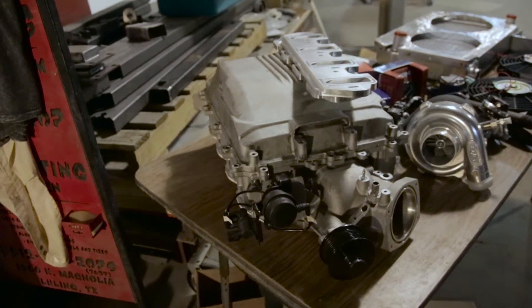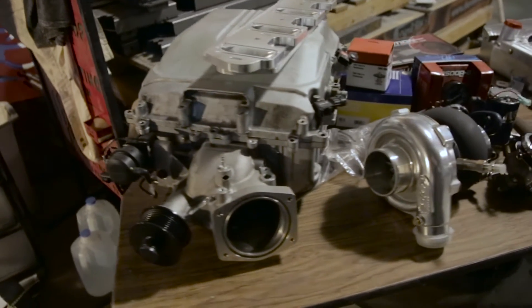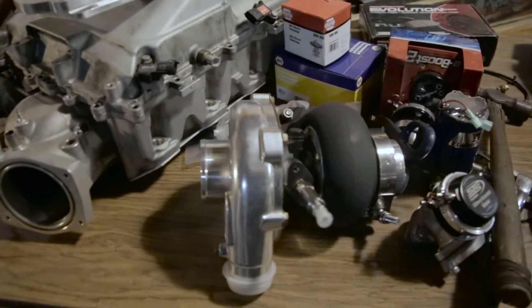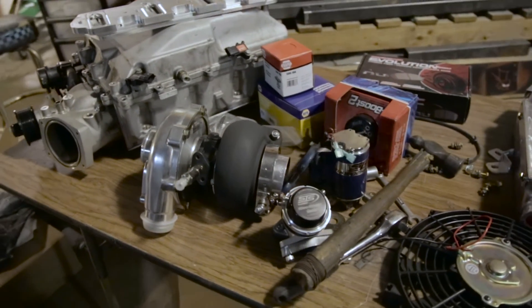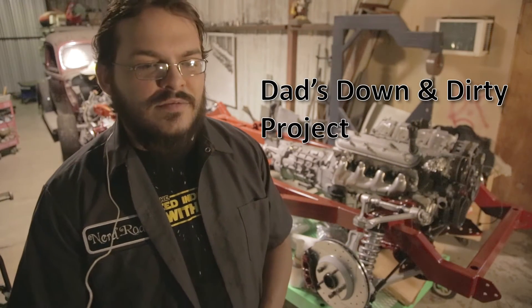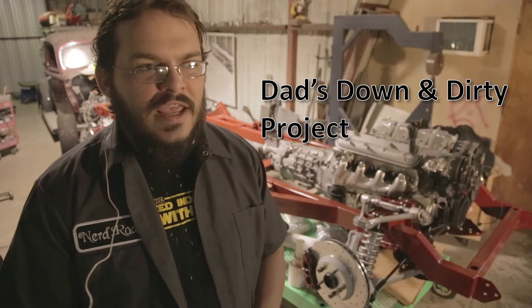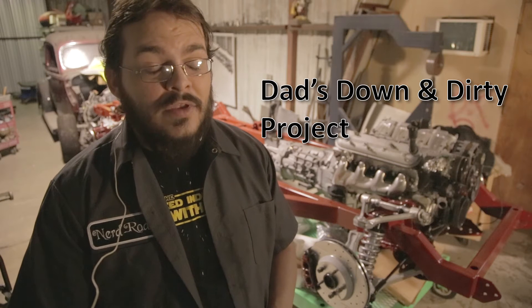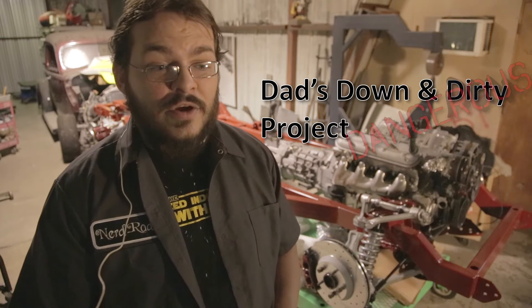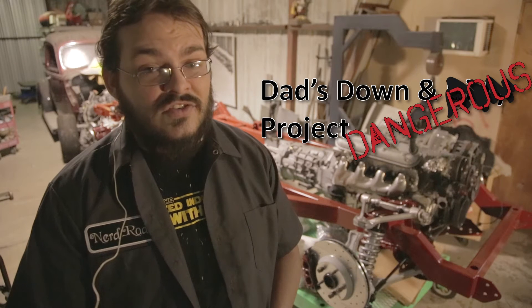But then one of my customers who was doing a big single turbo project — and I prefer turbos over superchargers — hit me up and said that LSA looked nice and would make his build easier. So I posed the question: you want to trade? So Dad's Down and Dirty Project, which started out with a 5.3, an automatic, and a Dana 36 differential with 3.08 gears, is now a 6-liter with a turbo cam, a 6-speed manual transmission, a Stage 3 Spec clutch, a 4.10 gear Dana 44 differential, some big monster tires, and a giant single STS turbo.